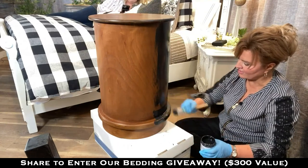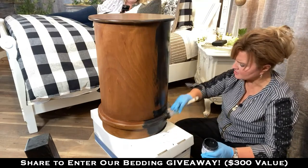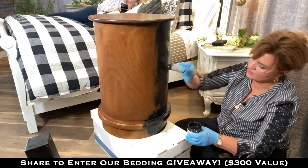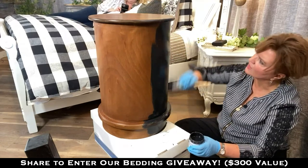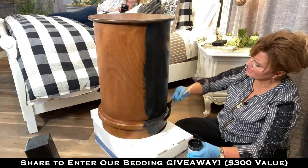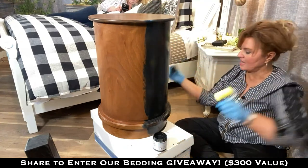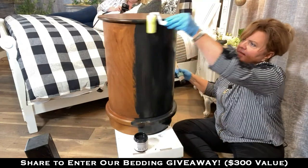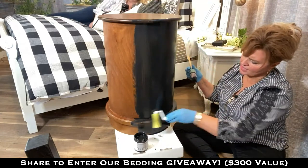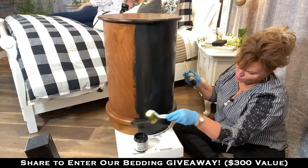That's how I paint at home — I lay across the floor and paint. This little banker box is pretty perfect for propping this nightstand up. I'm going to do brush and then I'm going to roll — look here what I'm going to do. I'm going to go back over that with a dry roller, just pull all those little strokes in. I can roll over it and maybe get by with one coat, or what I call one and a half, if I can just get that to look good.